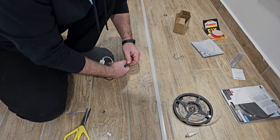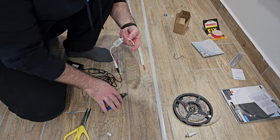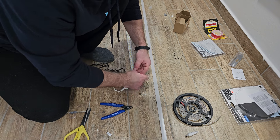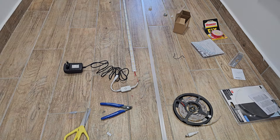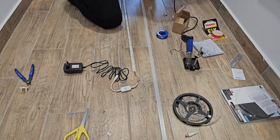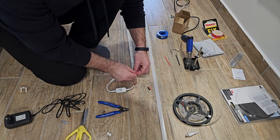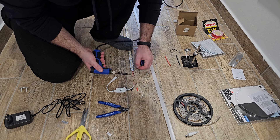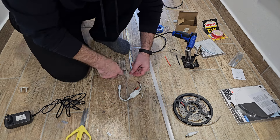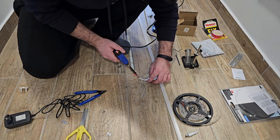From a wiring standpoint, I decided to solder the wires on the LED strip and directly into the switch. I used a heat-shrink tube and then isolated with a simple band. It makes it easier to install because in my case I was short on space. But you can find for a couple of dollars or euros a special wire which has a male and female connector that can be connected to the switch.